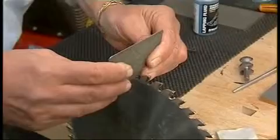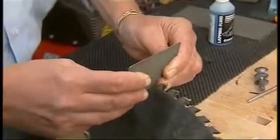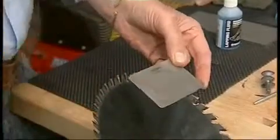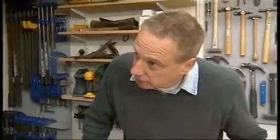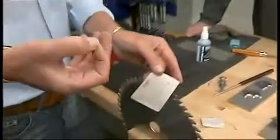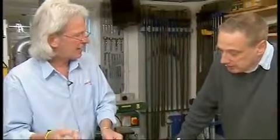Use the fine grit when working with carbide unless you've really got a messy saw blade. You can see how quickly I'm beginning to remove the carbide. So really you're working around the saw blade, two or three light strokes all the way around, and you put the edge back on your saw blade. I would suggest you sharpen it that way about three times, then on the fourth time send it away to be precision ground, so it's really getting back to spec. What I'm trying to say is interim sharpening will prolong the life of your saw blades tremendously.